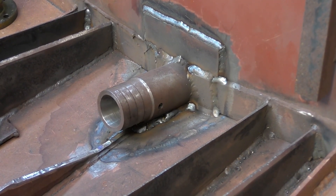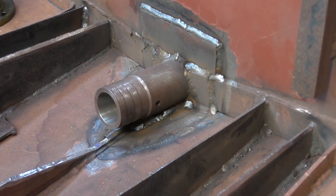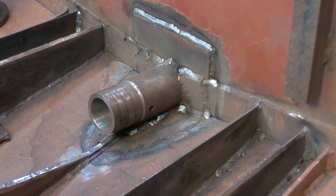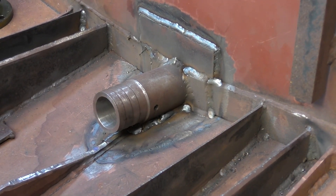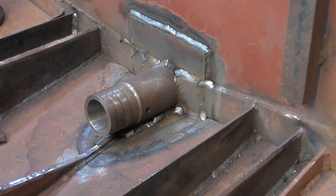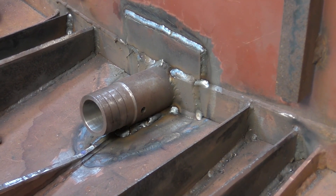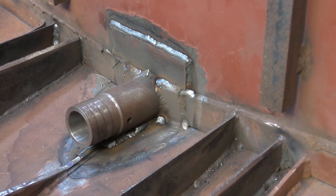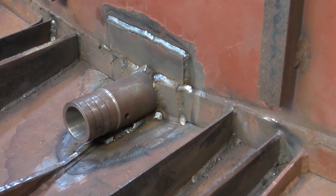Having a quick look at the internal forward end of the prop tube — you can see that's pretty much in place now. I've welded some heavy duty 6mm filler plates around that, which will keep it nice and solid. There won't be any movement or flexibility in that. I've checked the alignment, it's pretty much spot on, so I'm happy with that.